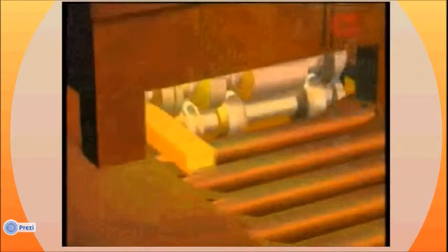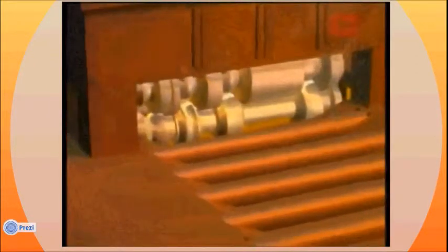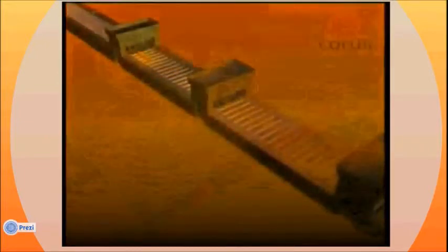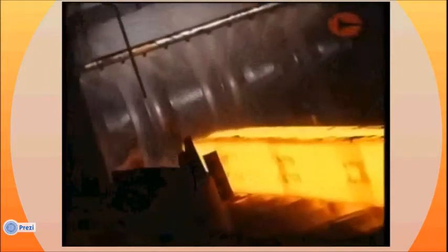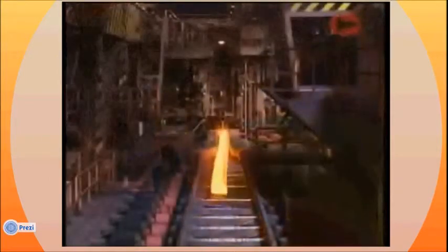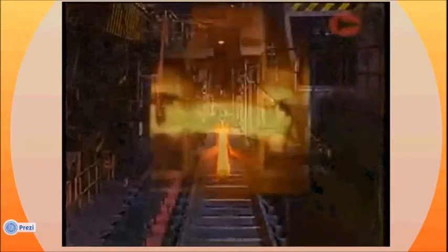The layout of a rolling mill can vary from a simple single stand mill to several stands positioned either side by side or in a line. The mill rolls themselves can either be plain for flat products such as strip used for cladding, or profiled for sections, beams and columns for use in construction. Mill stands have various roll arrangements depending on the product being rolled.